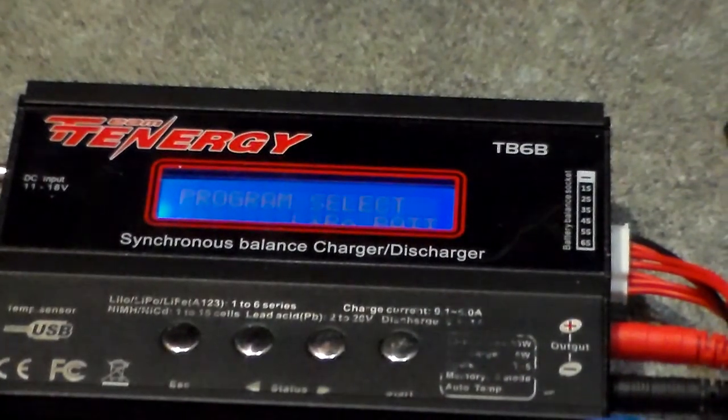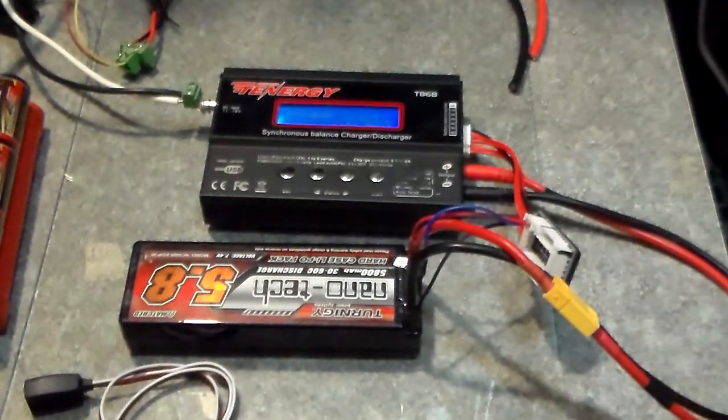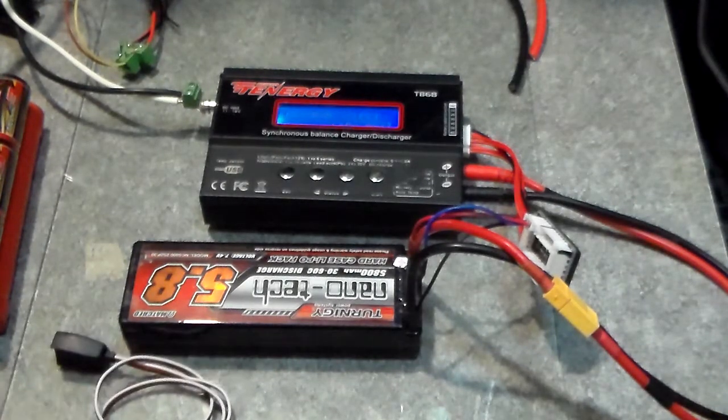One thing I missed was storing lithium batteries. Charging up a lithium battery to fully charged and then letting it sit is not always a good idea. However, if you've seen the video on a fully charged 18650 after 5 years, it didn't lose very much capacity, so don't stress about it. If you're not going to be doing RC for the winter or summer, then just store all your packs and charge them up next year. Don't discharge them down completely — that will ruin them.